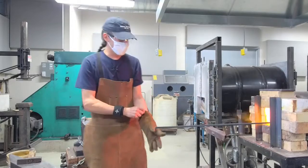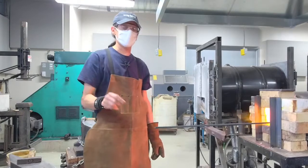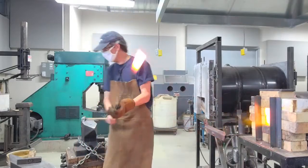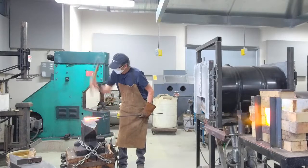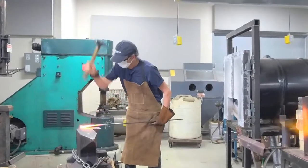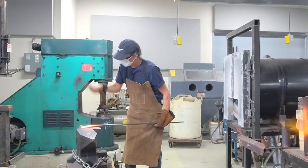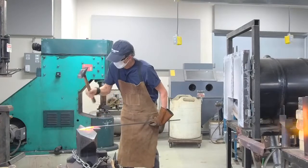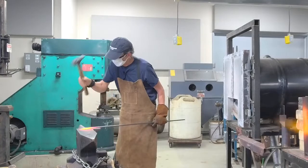For general mild steel forging I like about 2,000 degrees. I'm going to put a glove on and the first thing I'm going to do is make what we call a chisel taper — basically think of it like a flat screwdriver. I'll bring that over to the anvil and use my hammer. I typically hammer two sides of the metal and let the anvil do the other two sides for me.